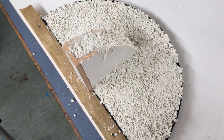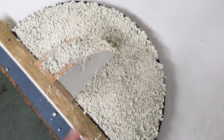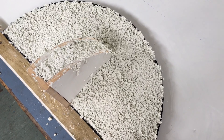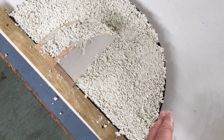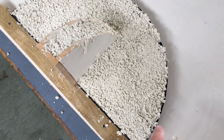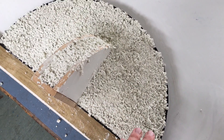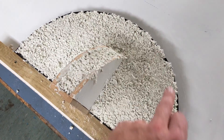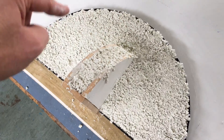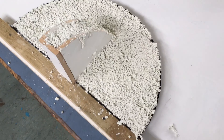So here we've got the form all filled up. I'm not too worried if there are some little rough edges because we're going to sand those down. I'm sure someone will ask why the nails were on the inside — well it's just a lot easier for that form to pop away. Plus I've made this probably about three or four millimeters wider than it needs to be just so we can sand the top edge, and therefore we won't have any indents from all the nails. That's something we learned from one of our previous builds.